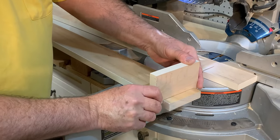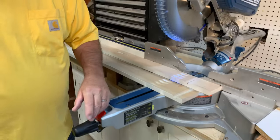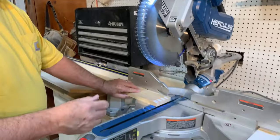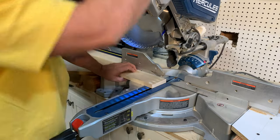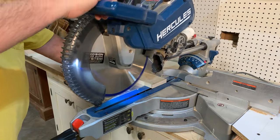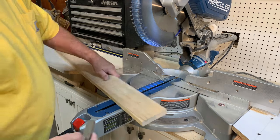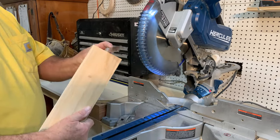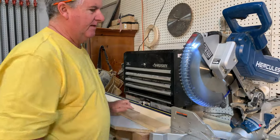Now I could have probably cut that a little less on that final pass, but you get the idea. Now I've got a nice dado if that's what I need for the project I'm working on. Let's check it for square. But first, let's flip that back up or we're still going to get that depth stop. Perfect that way as well. And again, I have never adjusted this. It's been perfect. I've had this for two years, I've gone through multiple blades. It's really a nice saw.